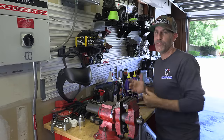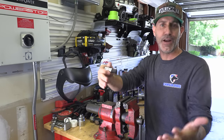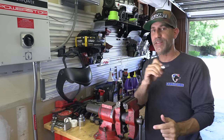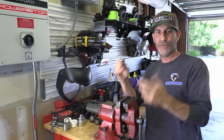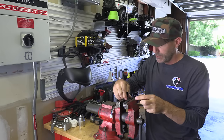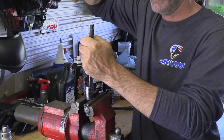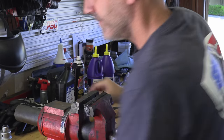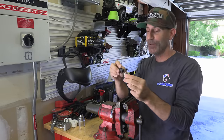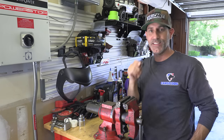I watched a couple of videos on what to expect and this is what inspired me to try to help you guys. I saw guys cutting these sockets to make this repair — please don't do that. These are tools, you don't have to cut them. Just take your socket and put it in a vice, grab a screwdriver, dowel, pin, or punch and knock out the insert. There you go — it's out, and you can put it back in and reuse the socket so you don't have to ruin the tool.